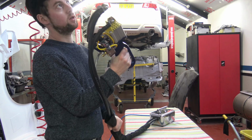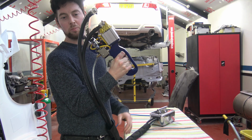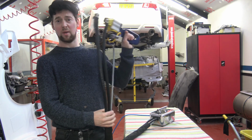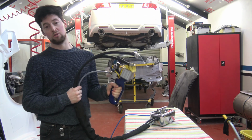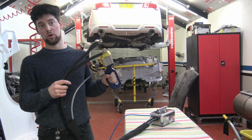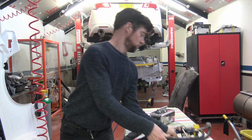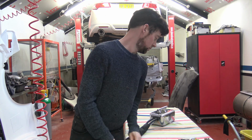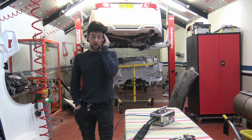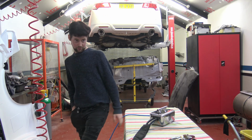I did have, what was the size, 72mm squared or something like that, but now it's up to 95mm squared. As you can see, it's not that bad. I didn't think they were going to be as heavy, but you need them, and if the heavy cables weren't on it, it wouldn't be as powerful and would be less efficient. These cables are to ensure that the secondary winding resistance is kept to a minimum.